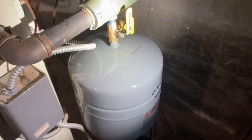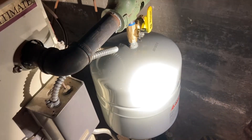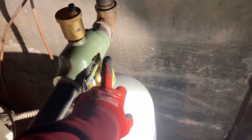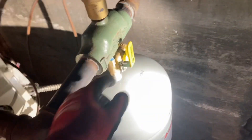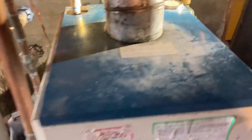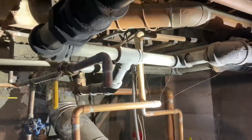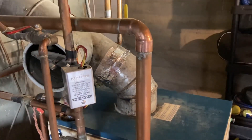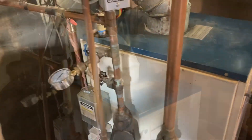What do we put on top of the tank? A service port - you can turn this off, you can purge it. What's this valve here allow us to do? So that you can take it off and test the air pressure in it. This is like a very specific word that starts with an I - this allows us to... isolate the tank from the system. Isolate. Good. That allows us to isolate the expansion tank from the system because this has got big hydronic main piping and a lot of water that we do not want to drain when we service this. So we put that valve in to allow us to check the tank without draining anything other than the expansion tank.